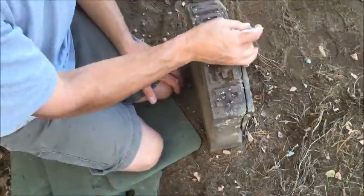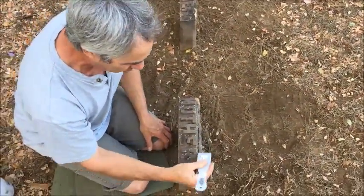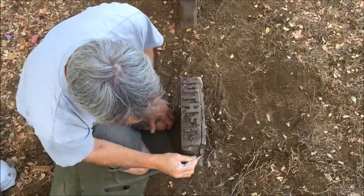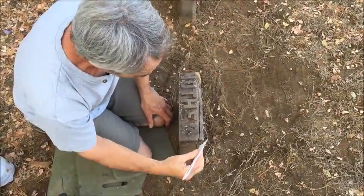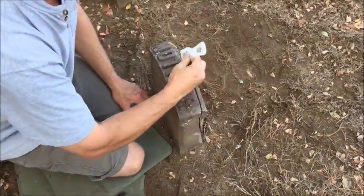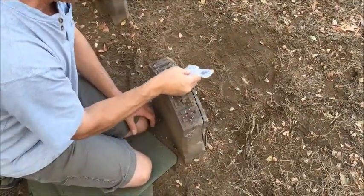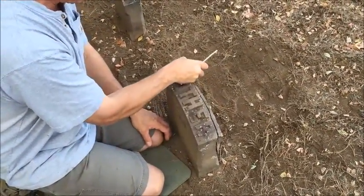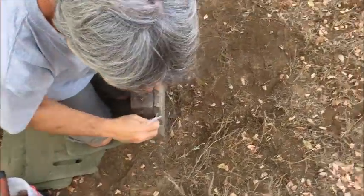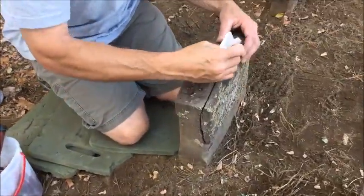This stone has already been pre-treated a good month ago with D2 biological cleaning solution, and that's why all the growth that's still on it just falls right off — it's all been killed off. But the tentacles are still attached because it was deeply rooted in here for so long, decades probably. I'm just going to go ahead and clean this off. We're going to do a little video about how we can fill in this crack and help stabilize the stone.